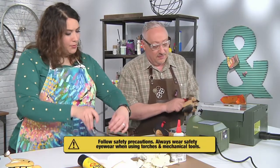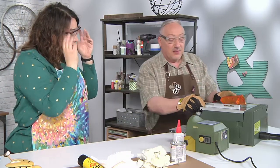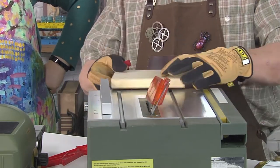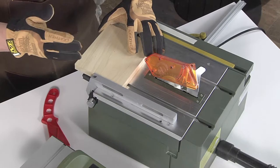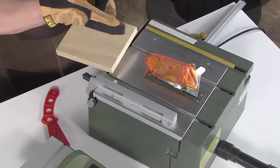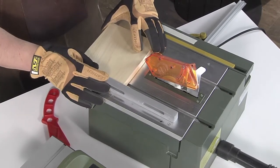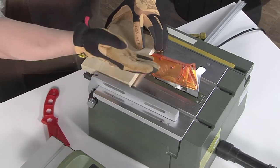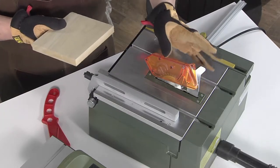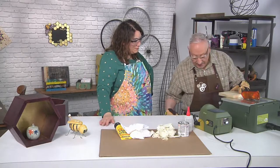So I'll put my gloves on, I will put my safety glasses on — you already have glasses — I'm ready to go. Now, the table saw has a fence, an adjustable fence, and we're tempted to use that. When you want pieces of wood that are the same size, you could adjust the fence and off you go. But a fence is typically used for what's called a rip cut — that's when you're going with the grain. We're going across the grain, so this could be a little bit dangerous. It can pinch up and cause kickback, and the board could fly and hit us. It's unlikely because we have what's called a riving knife — that's part of the safety feature — but just to be safe, I'm not going to use this. We're just going to set this aside.